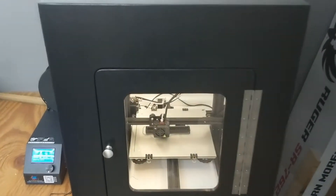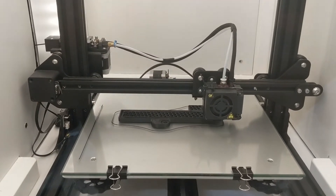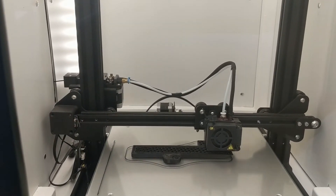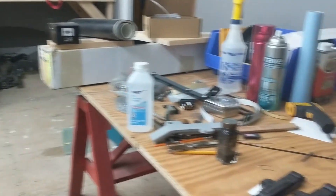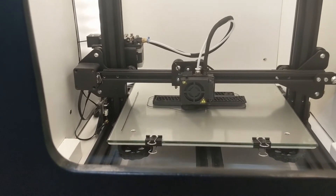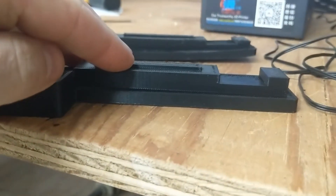My printer's all up and it's working right now — I'm actually printing a cabin air filter bracket for a Subaru, something I designed a while ago, and it's using ABS. I've got hairspray sprayed onto the glass and I can see everything crystal clear. The lights do a really good job lighting everything up. When I used my cardboard box I'd have to lift the flap and shine a flashlight in and try to peek at it, which was dangerous because ABS is very sensitive — if you get a draft it can curl your print. Here's a cabin filter bracket that's messed up and curled, versus this good one that's nice and flat.